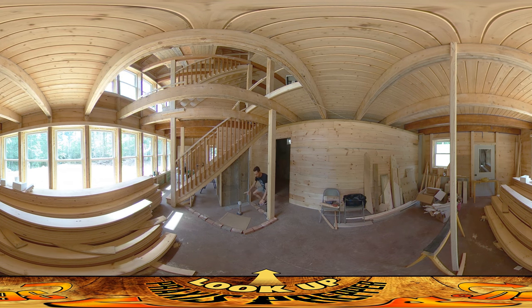The process is going to be: I'm going to start with the brick hearth first. I'll lay down some plastic so that the bricks don't directly connect here, because I want the bricks to be able to expand and contract at their own rate and not be stuck to the ground. As they heat up, if things are heating and cooling and expanding and contracting at different rates, you could get cracks. So there's going to be plastic on the bottom, then the bricks will all go in and they're going to go all the way through here and terminate just flush with the stairs over there.